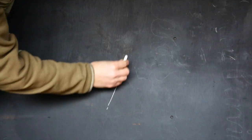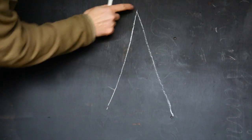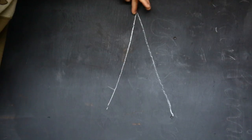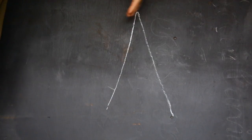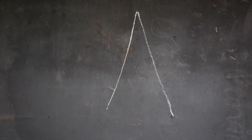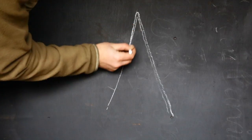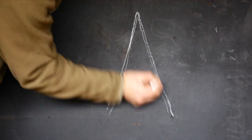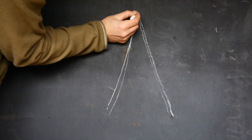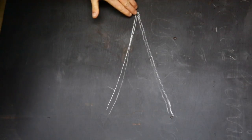The types of edges we use for woodworking are what we call zero ground — two flat surfaces coming right to a point. When edges become damaged, we've generally broken the edge there somehow — it could be a chip, the edge rolled over, or whatever. To get a new edge, we've got to remove metal from both surfaces to get back down to a new point. The most common fault with sharpening is people remove metal but don't remove enough to get right back to a new edge, leaving a little bit of the damaged edge still behind. With the coarse stone, you must remove enough metal to get back to a new edge.